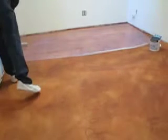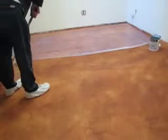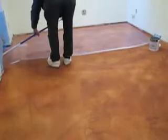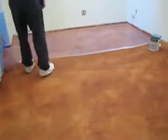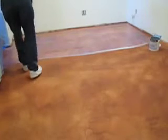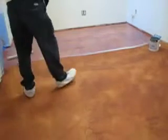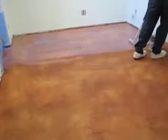That room can literally be done in less than 10 minutes in a typical situation like this. When it's dry, we like to intercoat — give it about one to two hours of dry time between coats. Then it'll take light traffic in about six hours. We try to tell people to let it dry for six to twelve hours, then you can put regular normal traffic on it in 24 hours. Full cure on this product will be five to seven days.